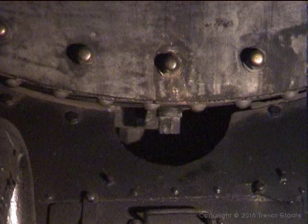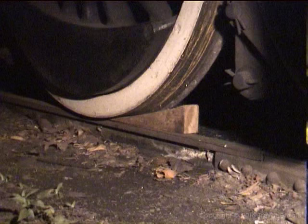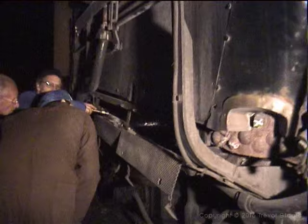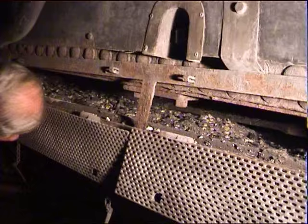Right. Blow out the cylinder cover, so that's why you must make sure that it is open. And we make sure we've got a chock. Let's have a further look here, light it up. In here, everything's connected up. Just another check, all the rods are there. So they can start up the injection. As long as there's water in the tender, that'll at least get it going.